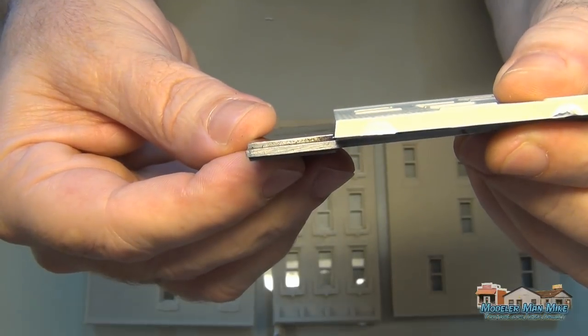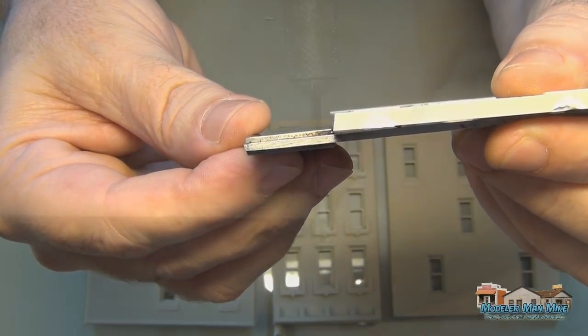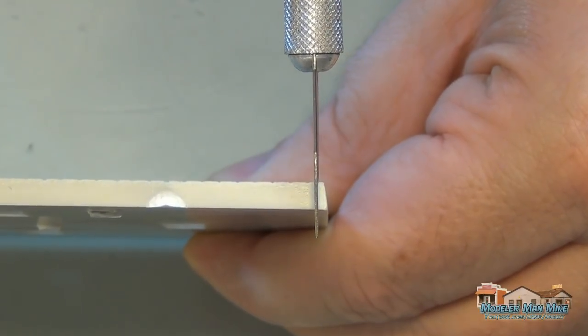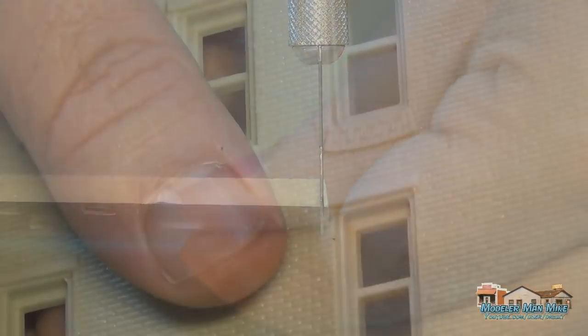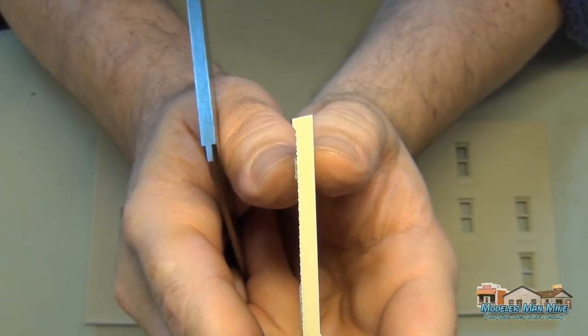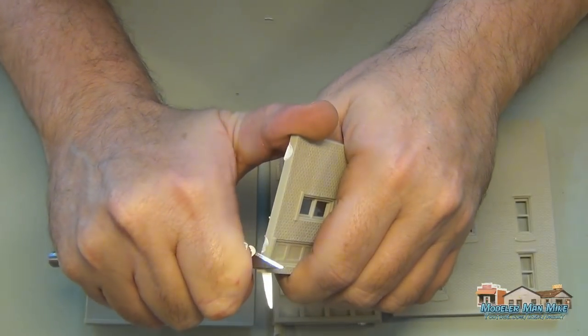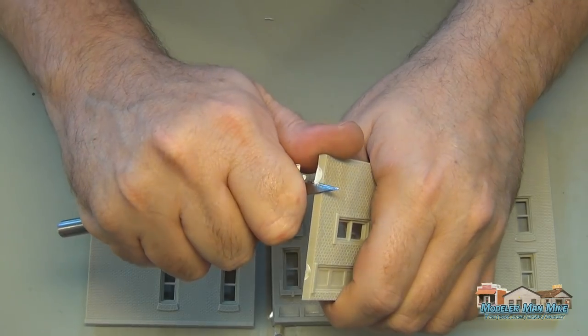Get a better look at this draft angle here — it's kind of an angled piece. What we want to do is remove this little bit off each one of these pieces to make sure everything squares up right. There's a draft angle on the top as well and on the bottom. I generally don't sand the top; I'll leave the tops as is.